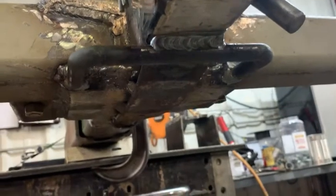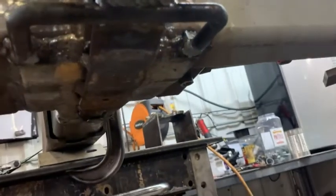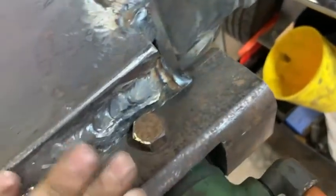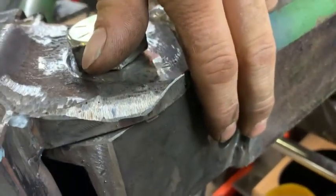It's turning out pretty well. I got the new safety chain bracket made out of a piece of a tire iron — five eighths high carbon steel. The older one I cut off because it wasn't going to work out for how I was putting this together. The other tube is two and a half inch by three eighths for the cylinder back. This right here is the stop — when it rotates all the way it hits here, at about an 80 degree angle, so it's not quite straight.